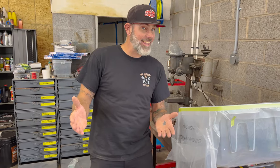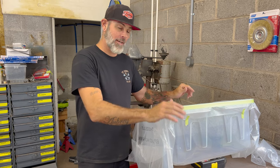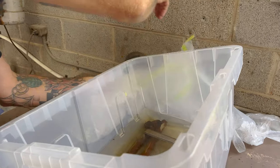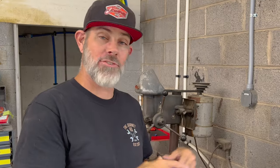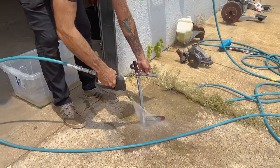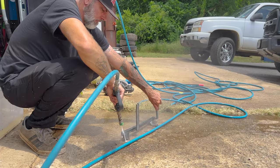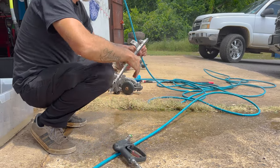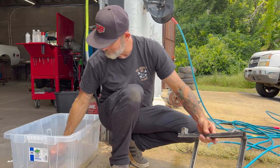Just like that, it's been 24 hours. Our parts have been sitting overnight wrapped in plastic in the vinegar. Let's get them out and see what they look like. You can already see the rust is starting to just flake right off. You can see where the metal was covered in rust and now it's flaking off. They still look like they haven't done much, but now we're gonna take them over to the pressure washer — it's just going to be like a magic eraser.